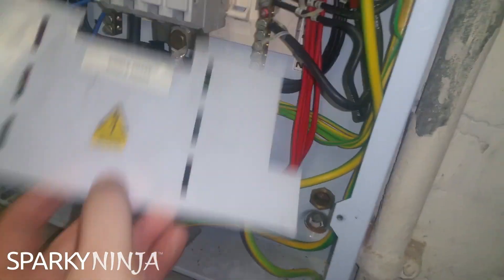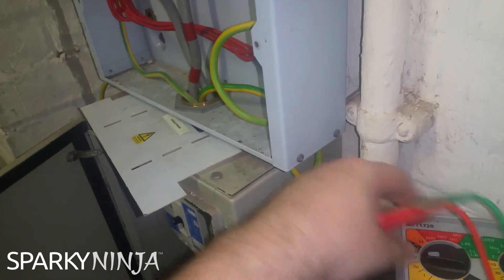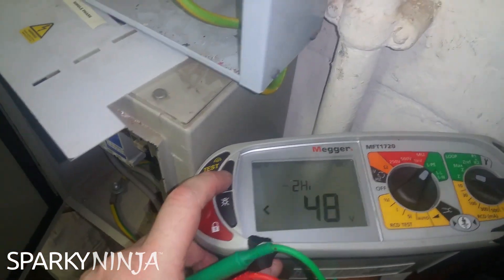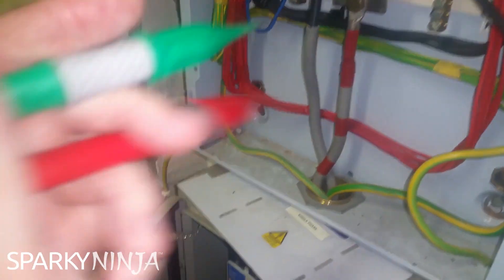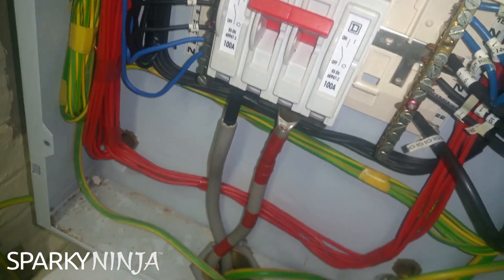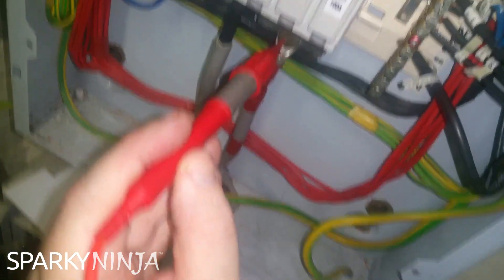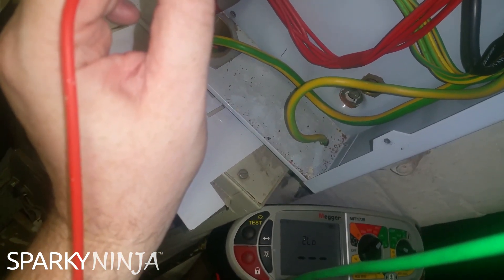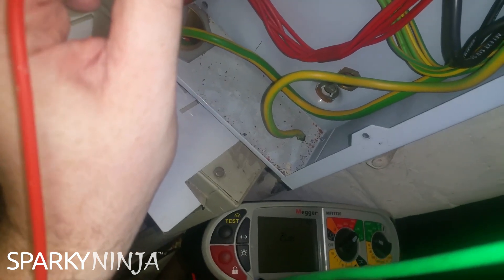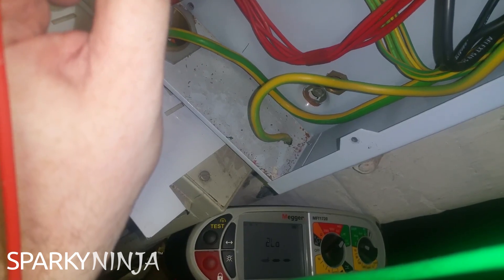All right, we'll keep it simple for the sake of sanity. This intermediate barrier doesn't really do much - a chocolate wrapper would do better. We'll set the tester up, turn her off, turn her on again, wake her up. Get the lead in the right place. I'll do another video later on where we actually do the polarity check. I'm going to do two-lead low current. I'm going to apply the earth onto the earth there, hold that, it's got the earth on there, it's got on the line. Two-lead low current test.